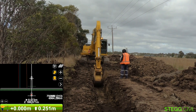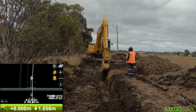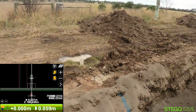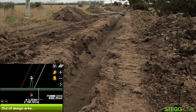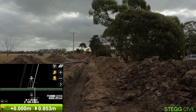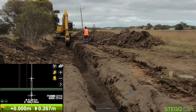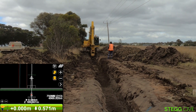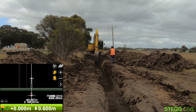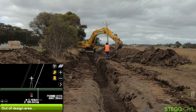Now he's going to heel that trench and it's ready for pipe. He'll set himself up on the next alignment and keep going from there. Great use case for GPS machine control — this water service going into the paddock has been potholed and we've got that on the file so you can see all your services as you go. No one's worrying about paint lines or string lines, no muddy boots in the morning trying to get paint lines out — no downtime moving the machine out of the way. All these guys are being better utilized elsewhere, laying the pipes or spotting for the power lines.